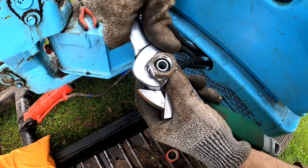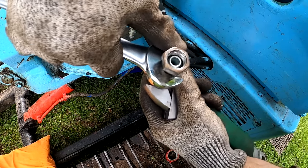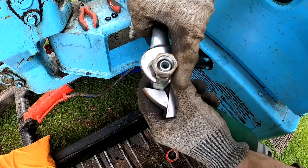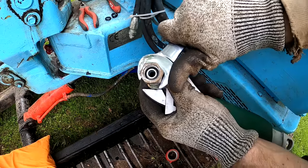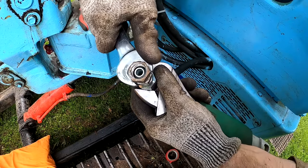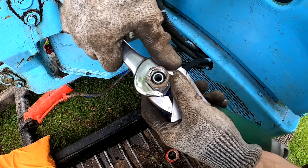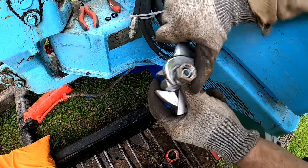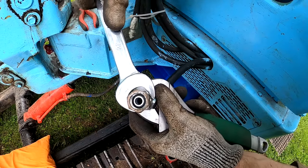Not really sure how tight they need to be, as I've never really seen a hydraulic coupler like this. But if this fix does work, then it's great, because that means you can pretty much just fix your hoses on the spot. With the pressed on hose, you have to take it to a hydraulic shop.